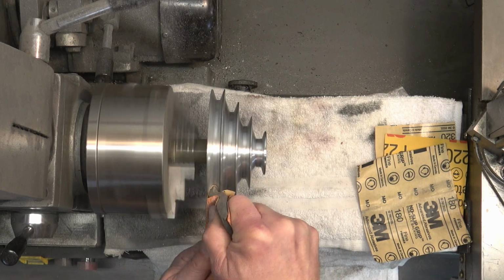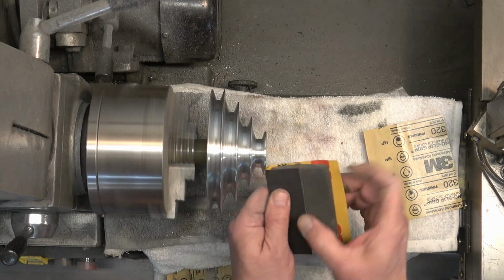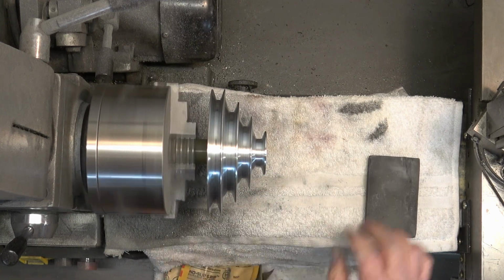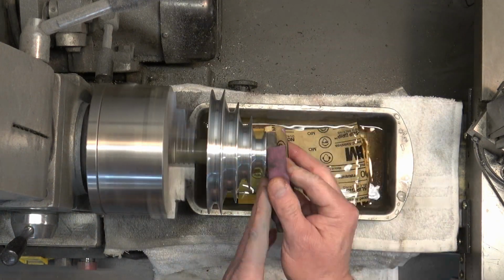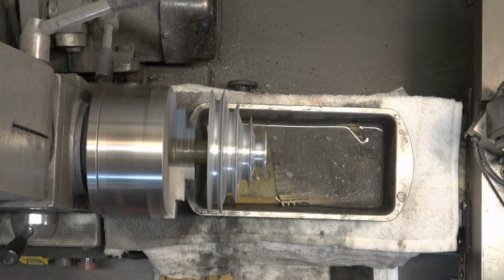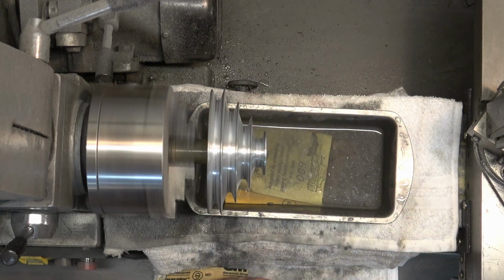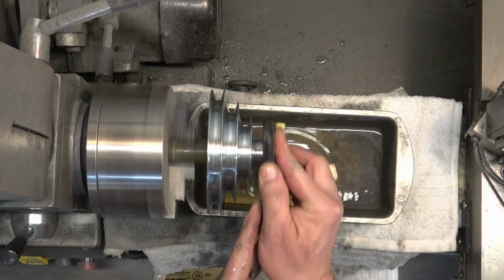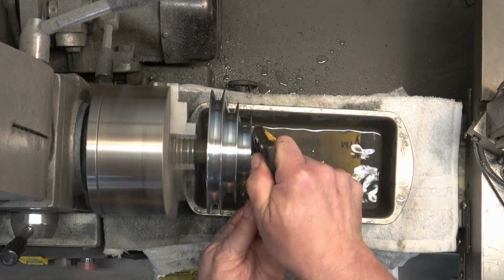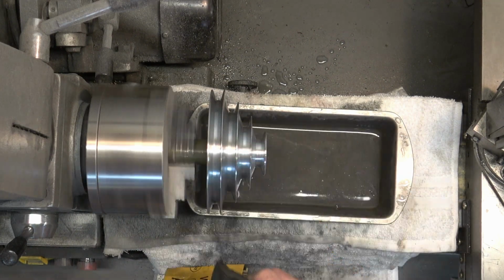So I'm polishing them. Also of note is that these are the exact same pulleys, the spindle pulley assembly and the motor pulley, that are utilized on all of your previous generations. So your Emerson Gen 1s, which are really 150 drill presses, and your 100 series drill presses, they all use this same pulley for the spindle and the same motor pulley. It's a 5-inch diameter 4-step pulley.